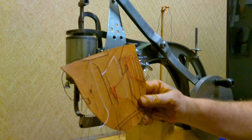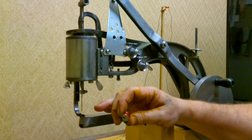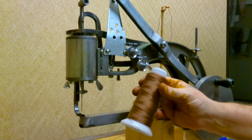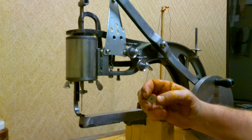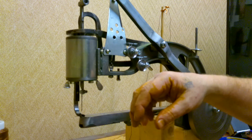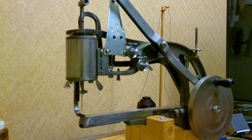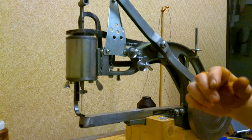One more tip: you've got to mess with your tension now because you're running a thicker thread. Also, these bobbins are not that big, so when sewing with the larger 207 thread my bobbin is actually wound with 135 thread. If I put 207 on these bobbins it's not going to hold very much and every 12 to 18 inches I'd have to stop to change bobbins. It doesn't affect the strength to a degree you have to worry about — it's still going to be a very durable and strong stitch. I hope the video helps somebody out; questions and comments, go ahead and ask in the comment section and I'll try to answer as best I can. Thanks for watching.